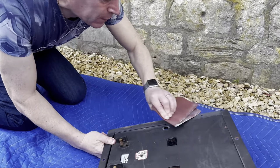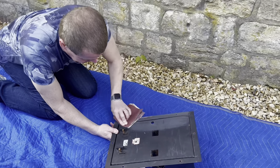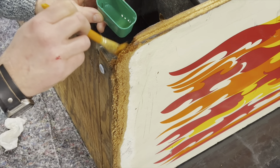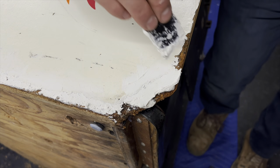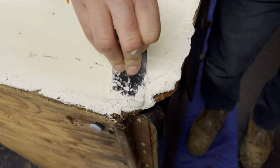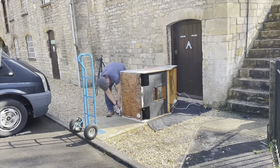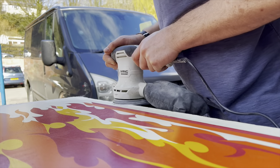In the meantime, our very own Tony Riccardi — our Ghosts and Goblins champ at the Arcade Archive — is helping rub down the coin door ready to be resprayed. I started to use some wood hardener around the edges of the cabinet where the chipboard had obviously had some water damage and become really soft. Once the wood was hard it created a good foundation to start adding filler and recreate the profile of what the cabinet used to look like. I did most of the filling and sanding outside and it took me all day to get the shape and finished surface right.